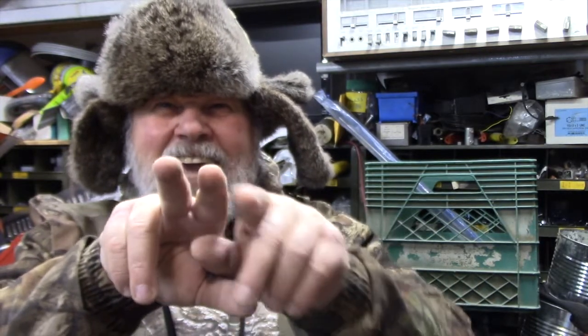I seen one guy one time. I'll tell you a story. A guy's got a well, okay? He's got a pump and a little caboose there, but he needs a heater in there, eh? And he's got a little 110 heater. So his pump's 220, so he's got a 220 circuit to the well, to the caboose. Now he wants to put a little heater in there. So what he does, he runs one side. He's got 220. That's just two wires, eh? There's no neutral. He needs a neutral to get 110. The ground has got the same potential as a neutral. So he puts his plug between the power and the ground.